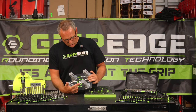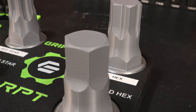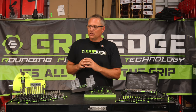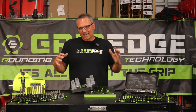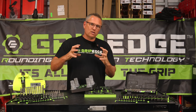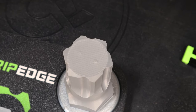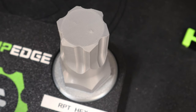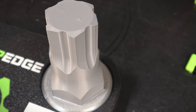They show your standard hex right here. Your standard hex is just square. What it does generally when you put it into a fastener is it literally pushes the fastener outward and spreads it open. Whereas an RPT actually grabs that fastener and brings it inward. You'll see on the RPT right here how it's kind of cut out, which allows the metal to cut in and grab.